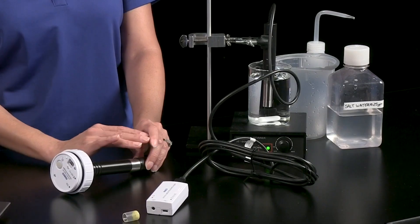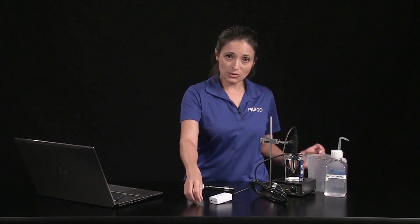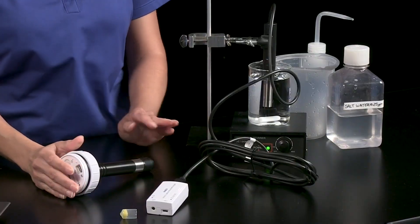Although you can measure oxygen gas in the air with the wireless ODO sensor, it's important to minimize the amount of time the probe end is exposed to air to keep the sensing layer at the end of the probe from drying out. Also make sure the boot sponge is thoroughly moistened, but not oversaturated with distilled water. And always store the probe with the sensing layer in contact with the sponge.